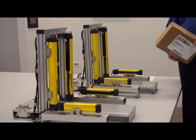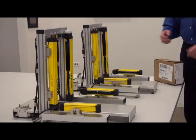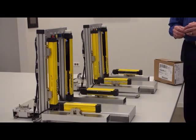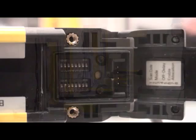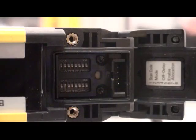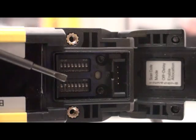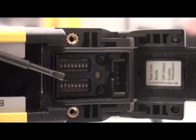How do you program that? You would take a dip switch on the receiver and program it by activating a dip switch to give you anti-chattering mode. On dip switch 2, it's active right now in chattering prevention mode, so it's up.